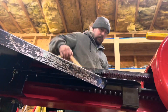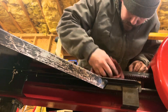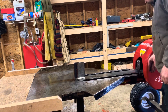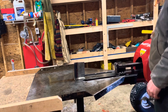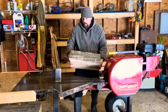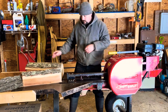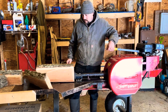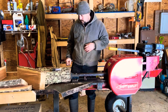I have a pretty liberal coat. I don't have any rubber gloves, so I ended up using an old trash bag. Now I'm wiping off any excess grease or anything off the beam, making sure everything looks good and slides nice. Now we're going to give it a test — see how good it returns by itself. See, it's returning nicely, which is what it should do. There are springs underneath, so you can actually replace those springs if needed, if the roller bearing alone doesn't make it return. Now we're going to try it on some red oak — make sure it returns by itself without me pushing it. It's returning nicely all the way, which is great. As I said in the other video, it's really important to keep that beam clean so that roller bearing rides out smooth.